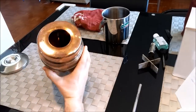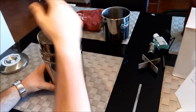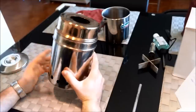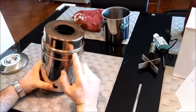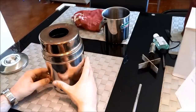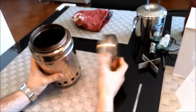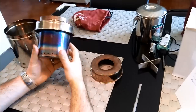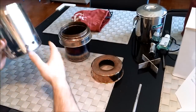You have a really nice concentrator ring — very solid, not going anywhere. It's not going to rust and it's going to last you a lifetime. This is 12 inches — sorry, 12 centimeters — in diameter, fits nice and flush on this stove here and everything worked out really nicely. So let's talk about what's gone into this stove in terms of dimensions of holes — the air holes — and we'll start with the outer tin.